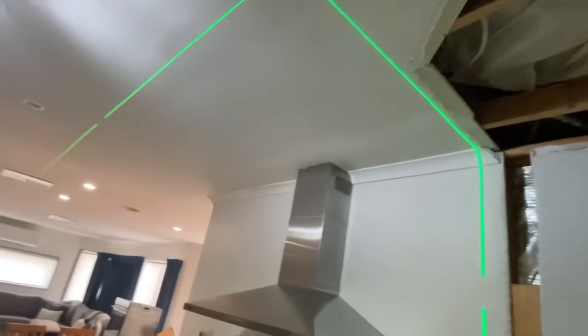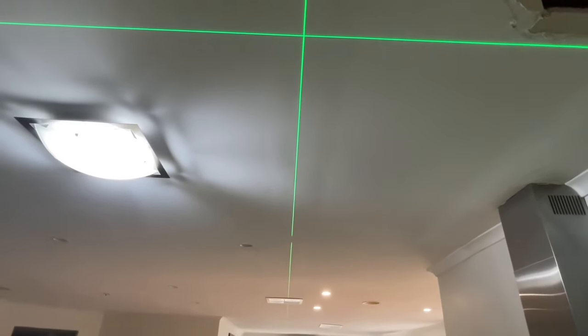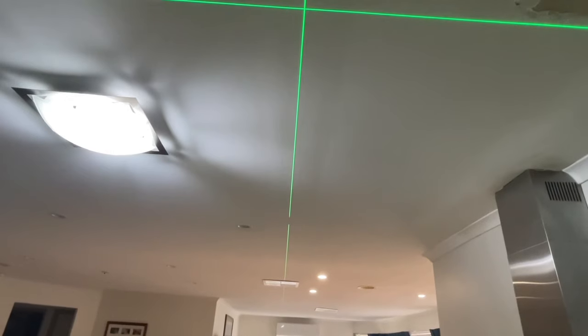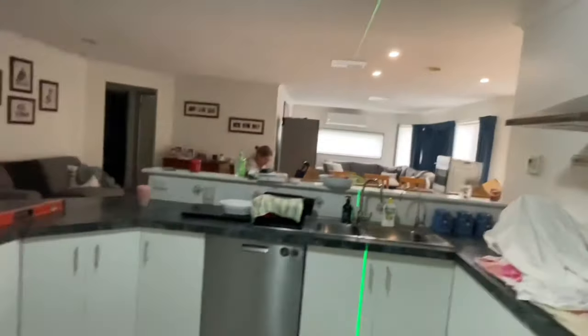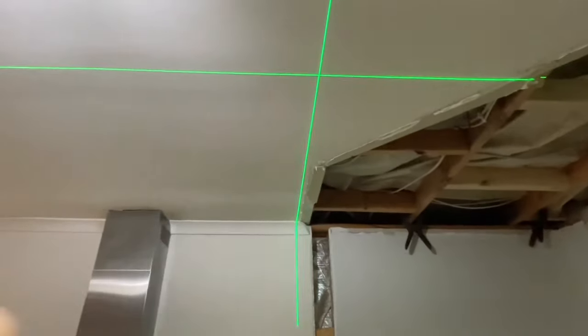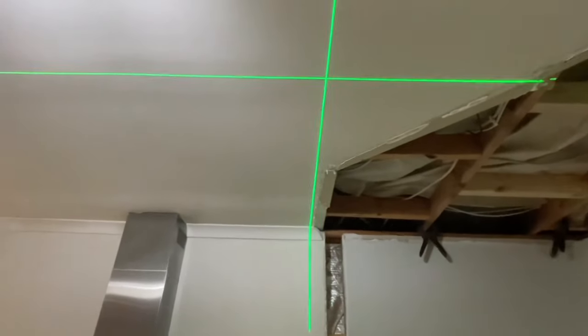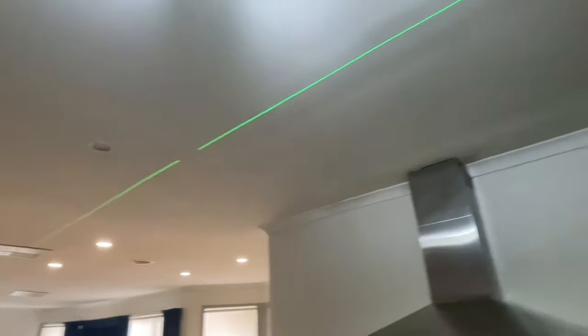And I've got the same thing happening. This one, you can actually see it. See that shadow that the light casts? It blocks it because it's sitting a little higher than the rest of it. That's a fill line for a plaster join too. So my laser is set up on that. And one I can't avoid, but it's actually, no, I don't think so, because the plaster runs in this direction. But there's no join here, but I can't get away without putting one in there. Have to join it somewhere, but at least it'll follow a natural progression from the original plaster join.